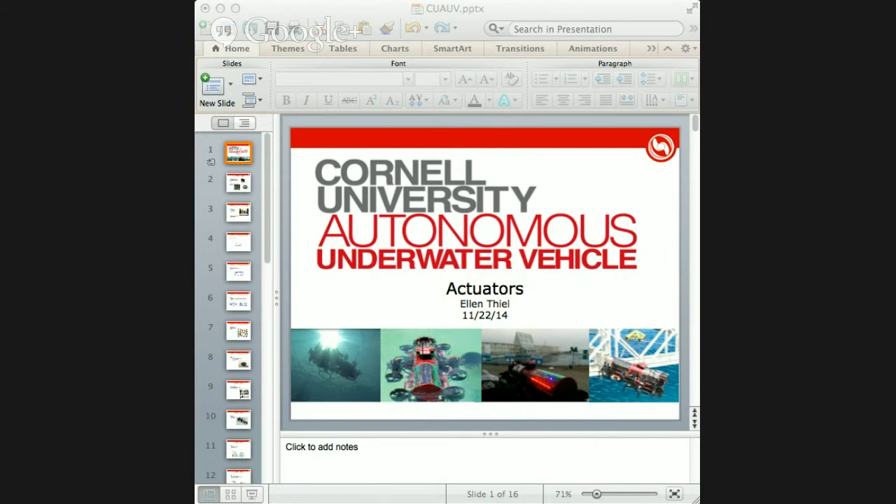A very common actuator system on AUVs is compressed air or CO2. For air, what we do is use a scuba tank, and we're able to get it refilled on campus. One reason we use air over CO2 is that we don't have a way to easily fill up CO2, but we're able to fill up the scuba tank for free. With CO2 you can get smaller cartridges, which is nice. For compressed air we use a scuba tank — it refills easily, just has a valve, and lasts a decent long time.